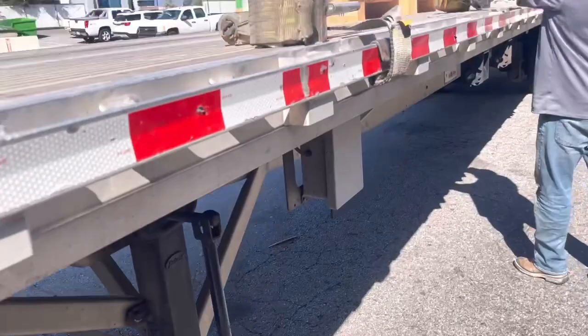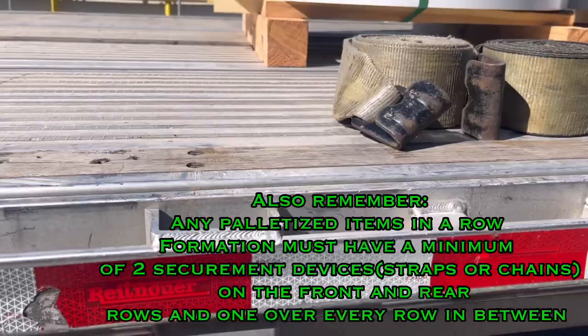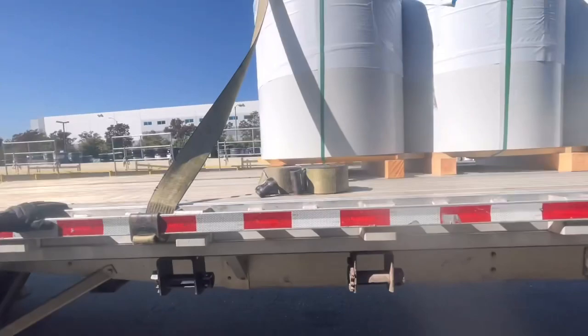So if you look here, we've got four coils. We're going to count first of all to find out what kind of length we have on deck here. When you talk about securement, you can talk about length and you can talk about by weight. Each one of these stake pockets is two foot apart. So you've got two, four, six, eight, ten, twelve — roughly 14 feet of product on deck.